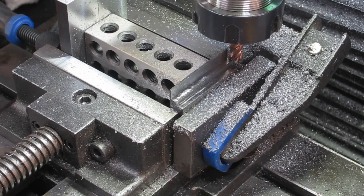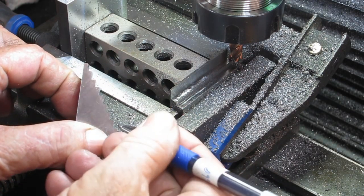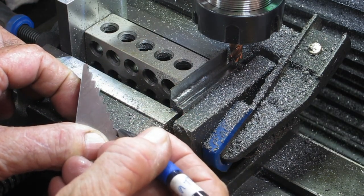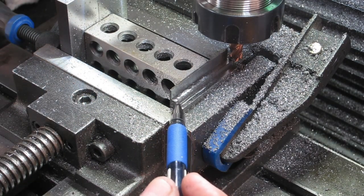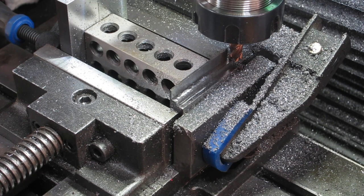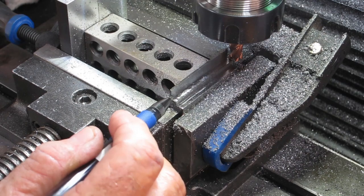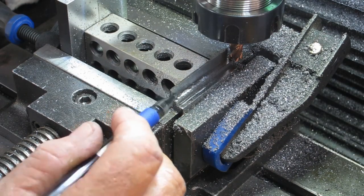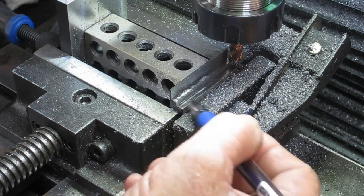Well, I've got to say, I've stuffed this up twice, believe it or not. Initially, I was cutting these the wrong way. The problem stems from the fact that I didn't cut these steps in the same dimensions, so one is nearly twice as long as the other. So I initially had the wider step coming down, but it's not down, it's in. So at the very most I can get two bits in here, but because I literally started from the top, I haven't even finished machining this away yet, and it's only 1.5mm thick, and it still has to have another 1.5mm taken out of it. So that would only leave one step here to grab on.